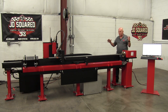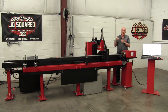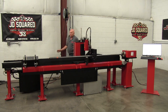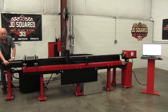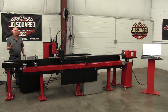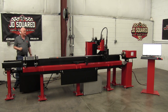These machines are designed to be bolted to the floor — they move fast enough that they must be bolted and leveled. This is a 12-foot frame; we make them in 12-foot and 6-foot sizes. The average person will probably go with a 24-foot machine, so the cable carriers and all wiring start on this end of the machine. That way you can bolt another frame extension right to this one and have a 24-foot machine without rewiring in the field, which is an expensive proposition. We've gone to the extra expense of pre-installing more cable carrier and wire so you can expand later.